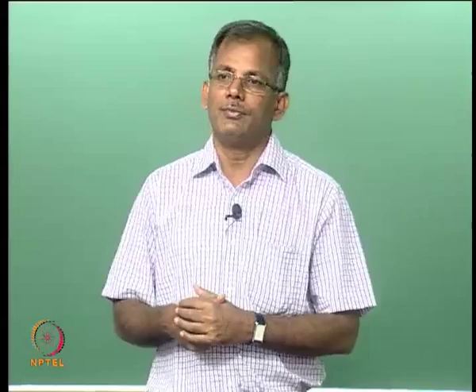This is the idea behind ship design and any floating structure design, even jacket design. Every member is buoyant, but if one member is flooded due to damage, the jacket can still float because it is only a small portion of the total system — that is the redundancy we try to create. Also for ballasting, if you have compartments, controlling the location and precise amount of ballast will be easy to manipulate.